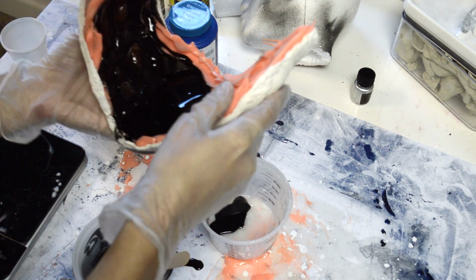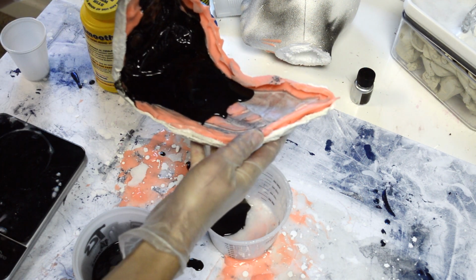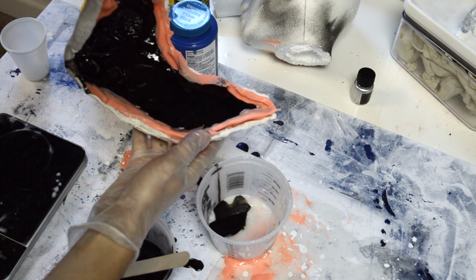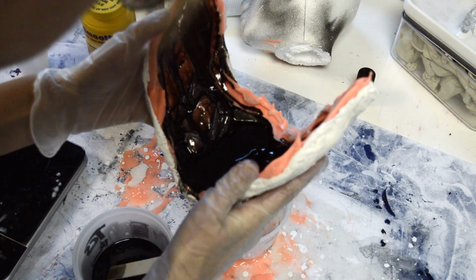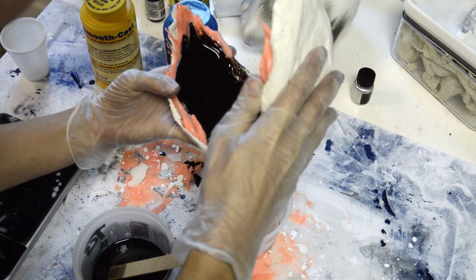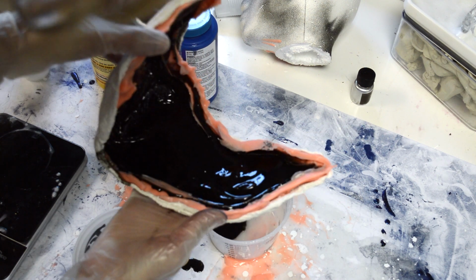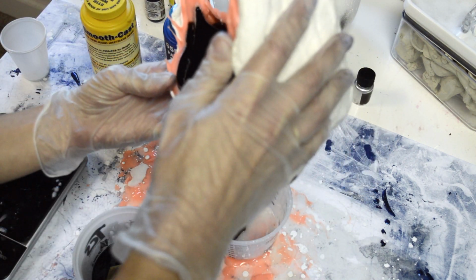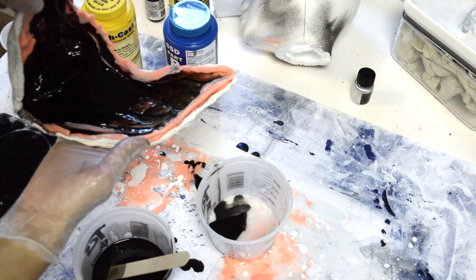That's okay. Just slowly rotate your mold back and forth to cover all of the exposed sections that you're trying to cast. So I start in the middle and do one side and then slowly rotate to the other. And then over time, it takes, I believe, 15 minutes or something for this to cure. You're just going to spend the time to sit here and slowly rotate back and forth, making sure that the 65D is covering all of the sections as it thickens and begins to cure.